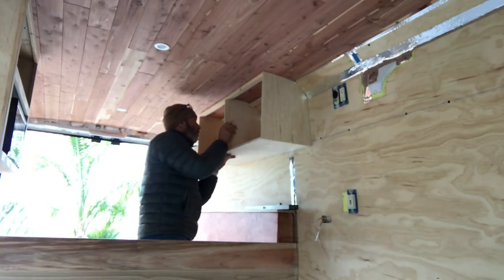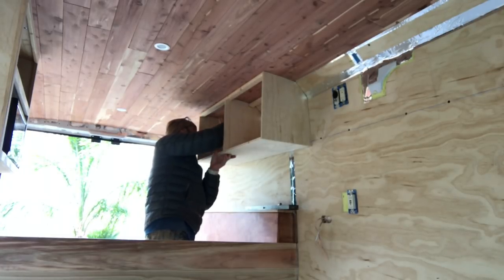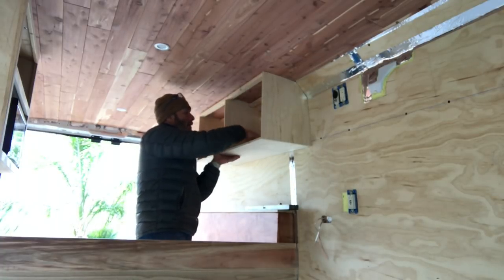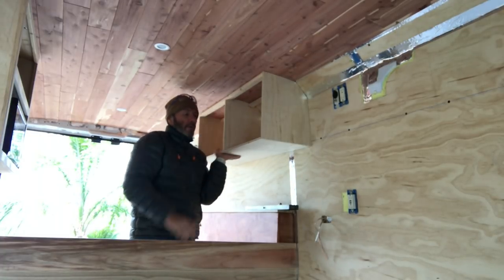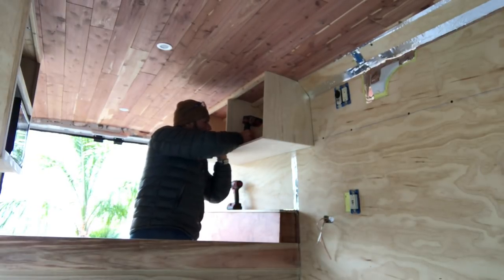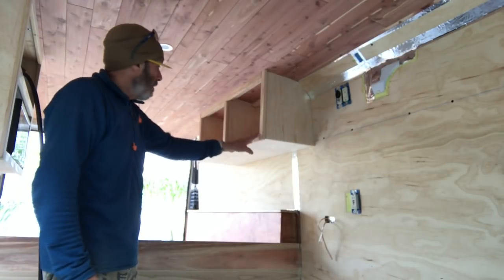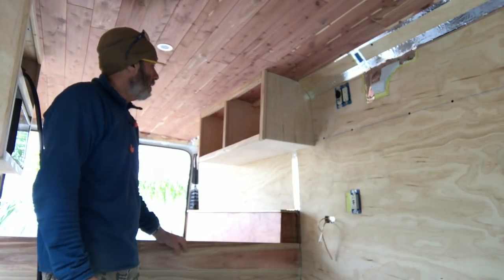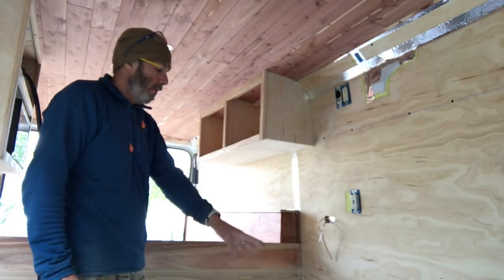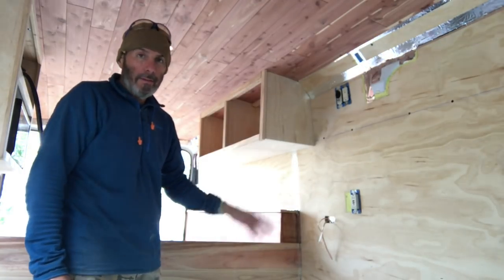Now I make marks where the roof struts are going, so I'll pre-drill those holes. And then screw here, here, here, and here. Then put the face frame on and start building that cabinet down there. So there's the finished box. All this gets veneered. Now I'm going to build the two-bank of drawers here that are going to hold our clothes and toiletries and that kind of thing.